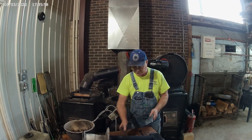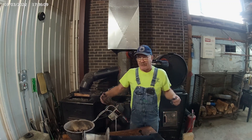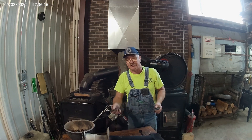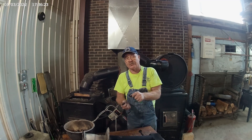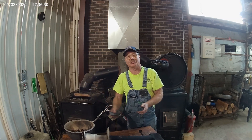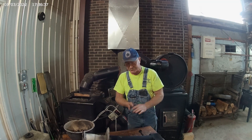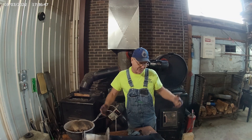The other thing I'm going to show you as soon as I get time is we built a filter crusher. When we change oil in a big tractor or a big truck, I made a crusher that takes those filters and completely crushes them all the way down to nothing, and it catches all the oil that comes out of the filter in a pan on the bottom. When they're all crushed there's no oil left in them, so they go into the scrap steel pile. The oil goes into the oil tote, and after it sits for a few days we pull off the top to fill our waste oil. Environmentally, it doesn't get any better than that — it's about as clean as you can get, and you get some good out of your waste oil.